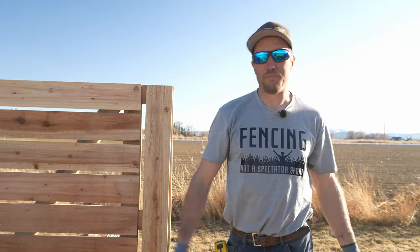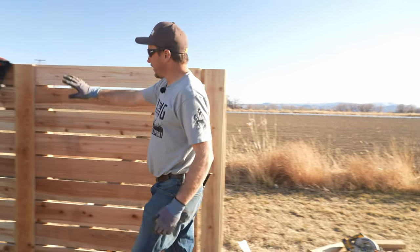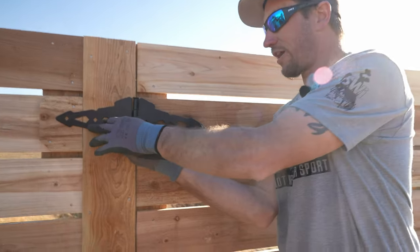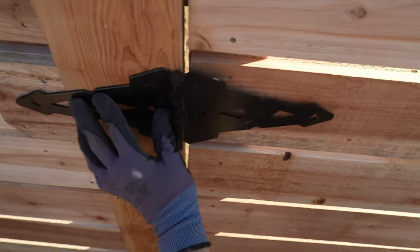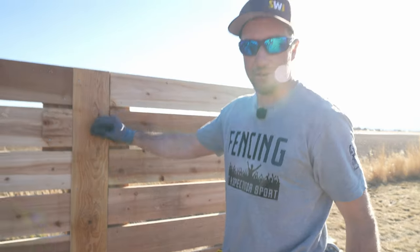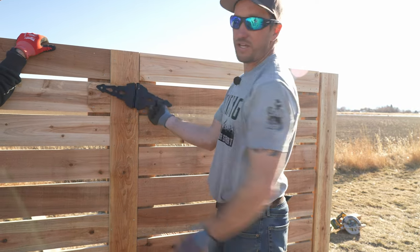Because it is a horizontal gate there's a lot of trimming to deal with. We added a cover plate on the fence side, so the planes are offset — we come across the fence just fine, but now we have a gap at the gate. We need to cut another cover plate and put it on the gate so that the hinge sits on the same plane.